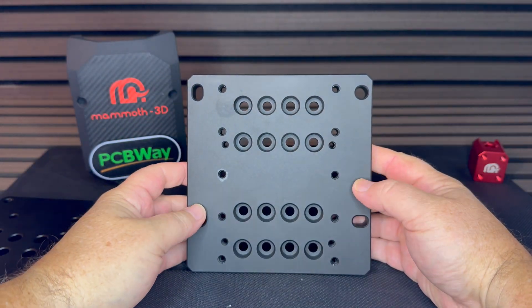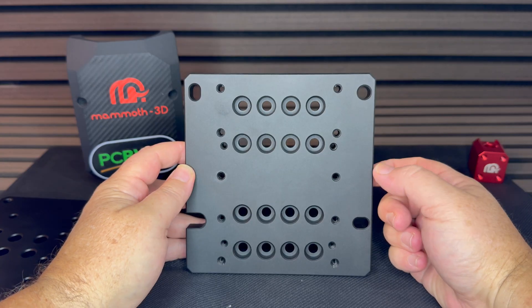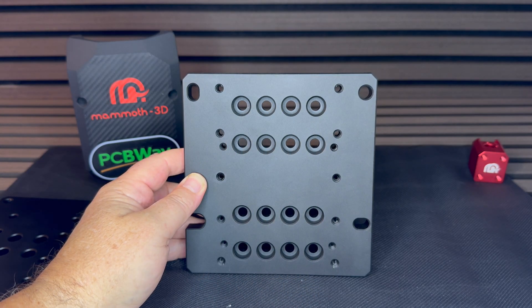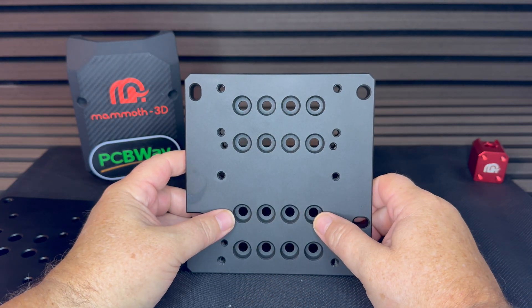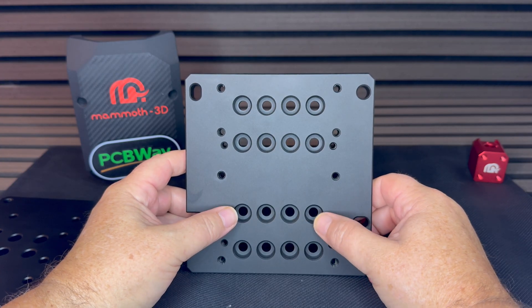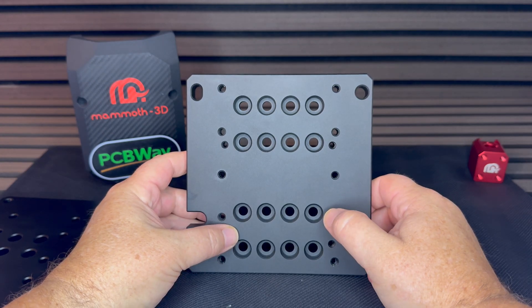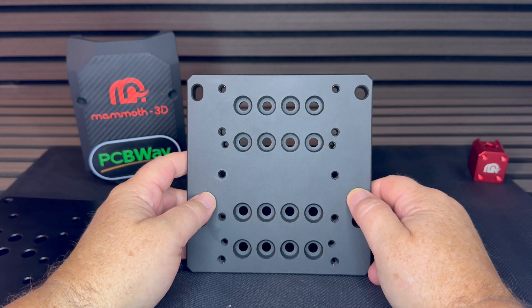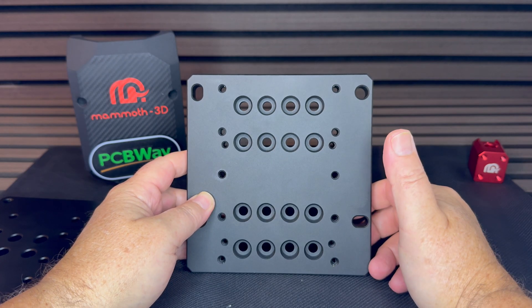This is the backside of the tramming plate. Normally if you see tramming plates, they come with six millimeter holes to hold the spindle. I decided to go with eight millimeter holes so we really have a good connection between the tramming plate and the spindle mount. In this series of upcoming videos, I did not order an aluminum spindle mount — I actually wanted to hear from you guys, so please comment below if you'd be interested in seeing an aluminum spindle mount. I'll be using a modified version of the Milo 3D printed spindle mount.